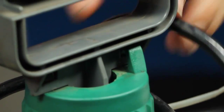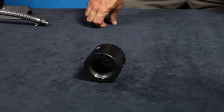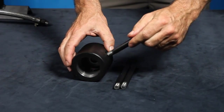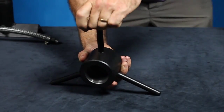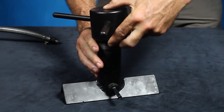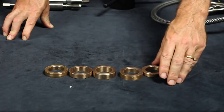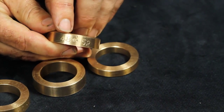The coolant delivery bottle is a pressure vessel for delivering coolant to the drill jig. It consists of a bottle, a flexible hose, and a delivery nozzle. The driver nut provides a slow and steady driving force for the drilling procedures — three arms are attached to allow for greater control. The spacer bushes are used to set the depth of the rebate depending on pipe size.